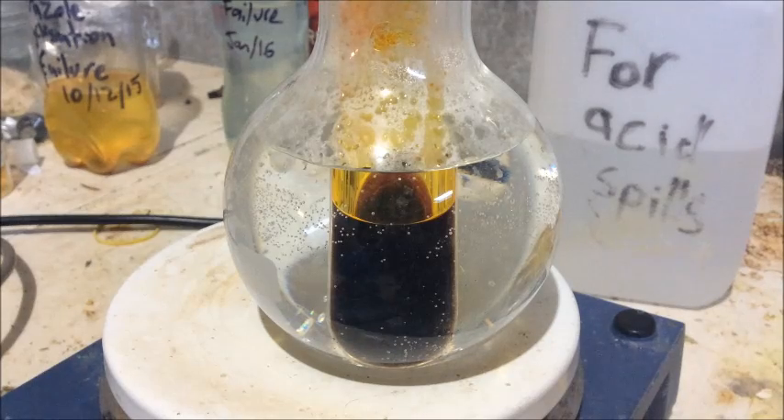It's hot enough now that all the dichromate and whatever the solids are in there have dissolved in the sulfuric acid. I've also added a small stir bar in there, which you can't even see rotating, to help dissolve all the solids, and I think it's basically done. I've never actually done this in a proper laboratory, so I don't really know what the end point you're looking for is, but I assume having it half an hour with cold and then hot, and a very concentrated chromic acid on it — I think every organic contaminant in there will be absolutely destroyed.